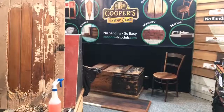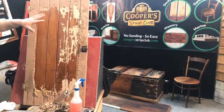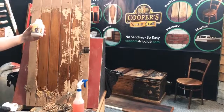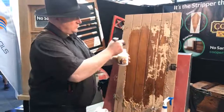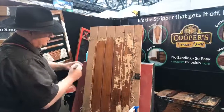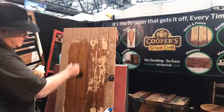While that's working, I just want to show you a wood finish. You can finish this now with anything you like — you can go straight on to a finish without sanding. You can use paint, polyurethane, anything like oils, no preparation needed. We have a finish called Moisturizer — it's a blend of gum, oil and wax, a lot like a skin care product. You put it straight on — you don't have to wait a good hour or more until all the solvents have evaporated out. But if you're doing the Moisturizer, you can do it straight away.